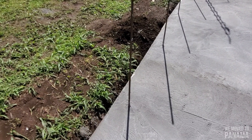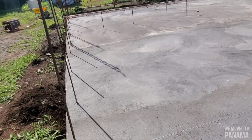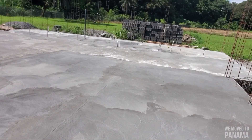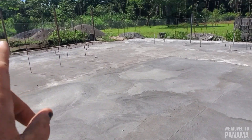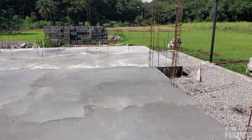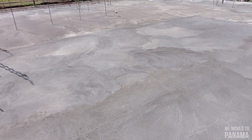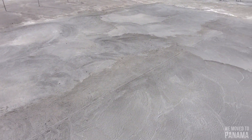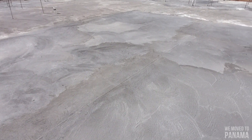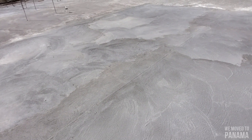My planks on the outside over here — to that side I did a line all across to that side board before we pour the concrete, to make sure that the two boards on both ends are all in line and level. I'm very pleased with how it came out because I took my level this morning and it was spot on — only very very slightly out.